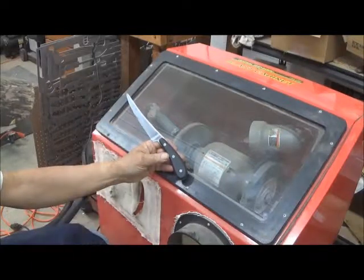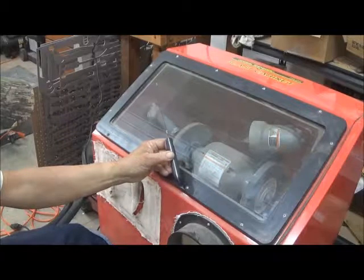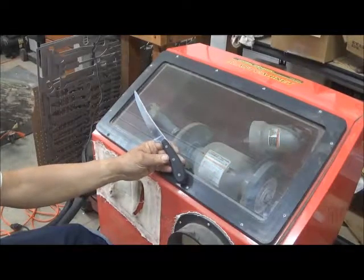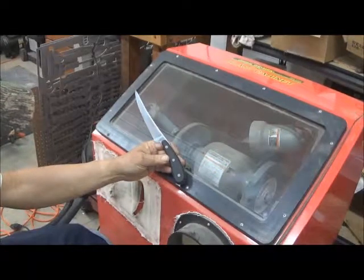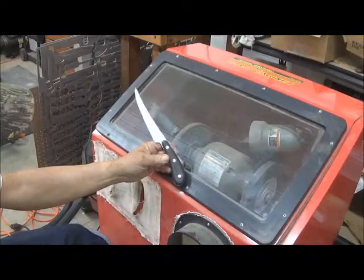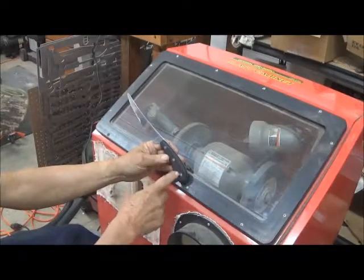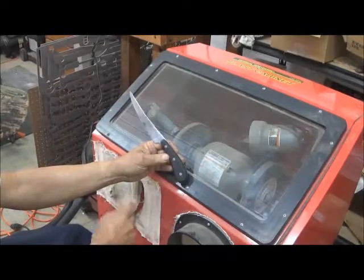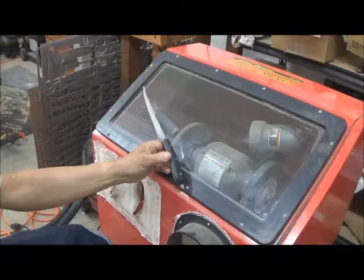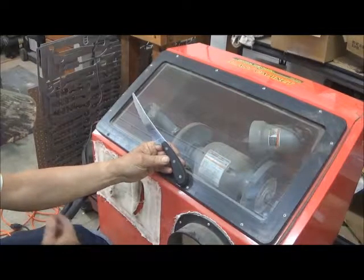I may be able to work it quickly on the grinder. This steel is so thin. We'll just have to see how it reacts. And also the handle material. I may have to reduce the speed of the grinder. This handle material may want to melt and gum up the grinder very, very badly. So we'll just try it and see what happens.